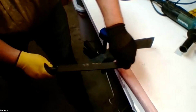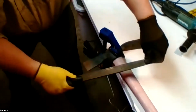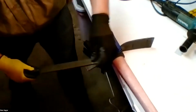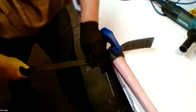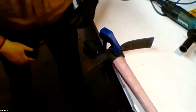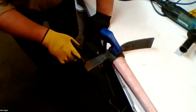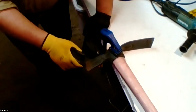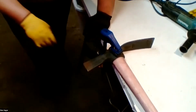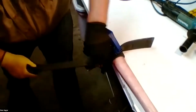You want to match that existing angle of your bevel. So you only press down enough to the point where you can tell material is being removed. Try the other side. That's a bit better. And I can see, you guys might not be able to see, but I'm starting to see some shine on this edge from where I've started to remove the rust and other material on the very top and produce a bit of a shine. There's shiny, fresh metal underneath. And I keep at that.